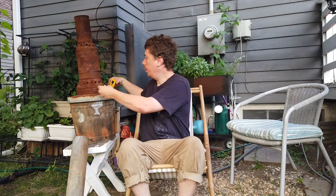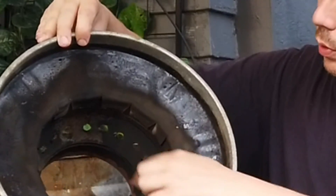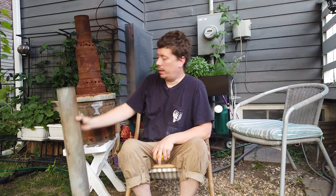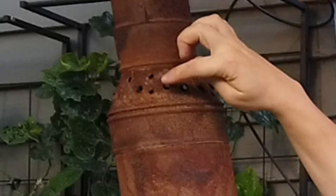In order to create your own T-LUD stove you just need some basic parts you can pick up at any hardware store or maybe a junkyard. The first thing is some kind of galvanized bucket — this one is about 14 inches across. Moving up the bucket, you cut a hole around the edge and create some fins, which are riveted to the next component: an 8-inch to 6-inch HVAC reducer with about quarter-inch to half-inch holes drilled all the way around — this is your air intake for the wood gas. On top of that, a 6-inch chimney, then a 6-inch to 4-inch reducer into the final chimney, with another stack on top to further reduce the gas. On the second intake I've added a lot of little holes to maximize the airflow. With those components alone you'll be able to create this at home.